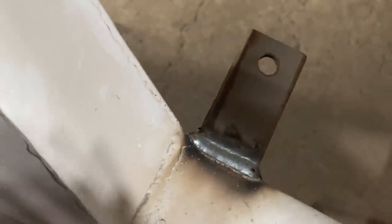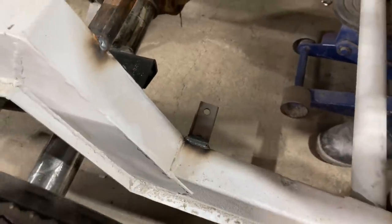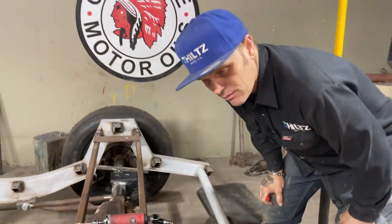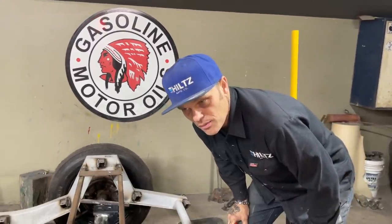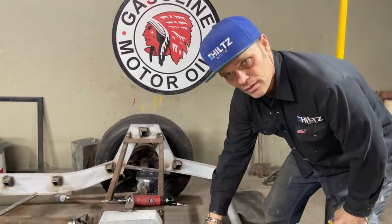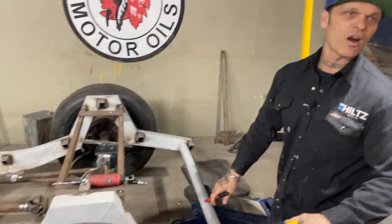But what has to happen is when I throw that spot of weld down there, and to make a bead like that, I have to see the wire in the middle of the puddle full time. If I do not keep the wire in the middle of the puddle, then it starts spinning and it's not welding. Was that one a little far away? Yep. There you go.